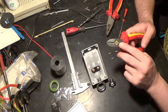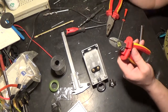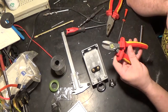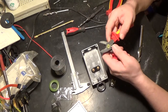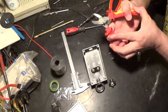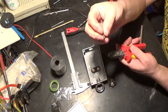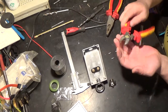You've also got this hole right here, which is for your 3.5 screws, so you can cut your screws nice and accurately by sticking them in the hole until it lines up. Of course, it goes in and you cut like that. As you can see, there's the old piece there, there's the other piece here, and there you go, it perfectly cuts the nickel brass or nickel plated brass 3.5 screws.